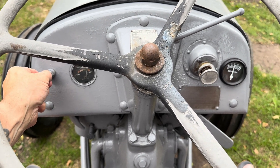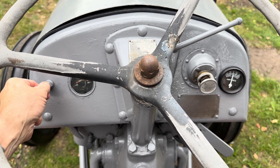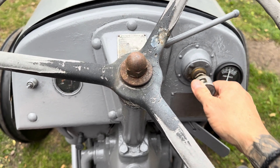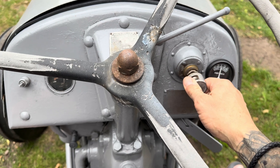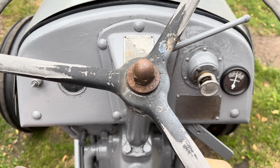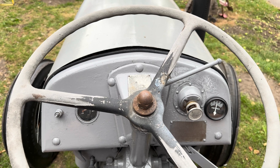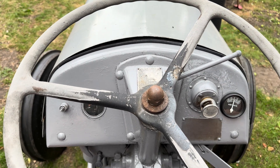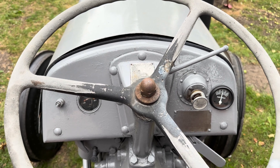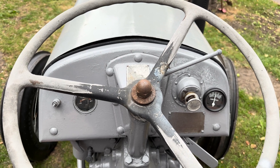Let's give it a go. We're going to pull on the switch. In the winter I'd normally hold that out for a good 10 to 15 seconds. You can feel some resistance — give it some fine vapor. And up it goes, on minimal throttle. You can see just how easy that started. It is certainly warmer weather right now, but in the winter it's absolutely fantastic.